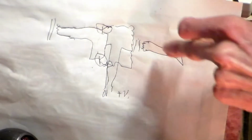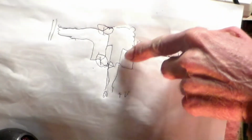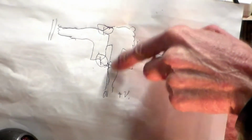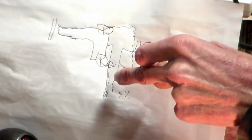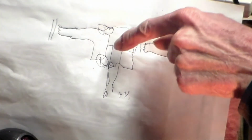This is the very basic, but I admit not very well drawn, Class AB circuit used in most of these radio speakers. Input transformer here. The battery goes into the input transformer and goes to both the transistors, which in this unit were both faulty, by the way. So I whipped them out, and emitters go to ground. There's a resistor and a capacitor somewhere as well, but I'll leave that out just for simplicity's sake, and of course it goes to the intermediate transformer here. So that's somewhere in push-pull and somewhere in class A or class AB. So that's basically how they work.